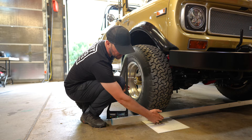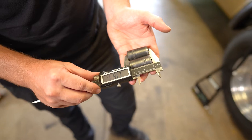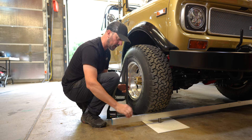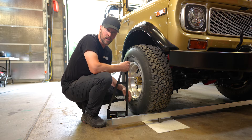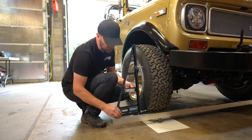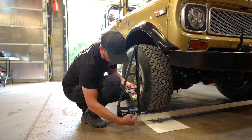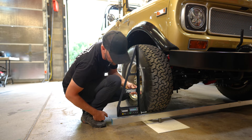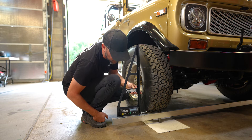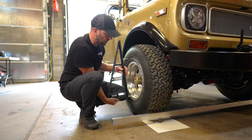You've got a socket here as a spacer — there's one on each side, they just want to be the same height. And then this long aluminum bar — I have aluminum stock, but you could use a long bubble level or a steel stud from the hardware store. This is just going to create a new horizontal plane that you'll do your alt zero off from. On the Gen 3 module, you're going to press hold and alt. You'll see that it reads alt, and it's going to continue to flash alt as you take your measurements, just to remind you that you're in an alt zero status.